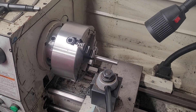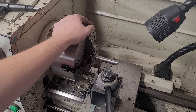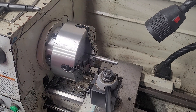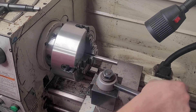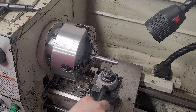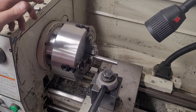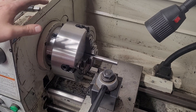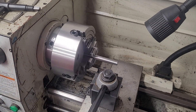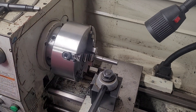One thing I want to make sure for myself is that I'm in B6, because that's really going to matter for the next step. And I'm going to have to do a test cut — in all honesty, I might actually just do it on this barrel stub I'm going to throw away anyway, to make sure I'm actually cutting a 1.5 millimeter pitch thread. So thanks for watching guys. I hope this gives you an idea of some of the work that goes into chambering a barrel. While this is a five-minute video, I'm about 40 minutes into setting this up so far, to make it not necessarily perfect, but very close to it.